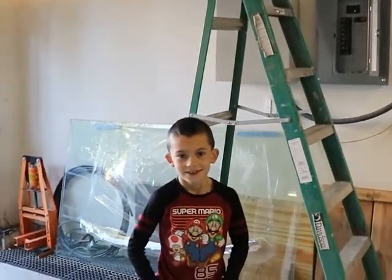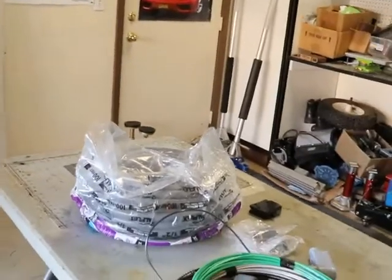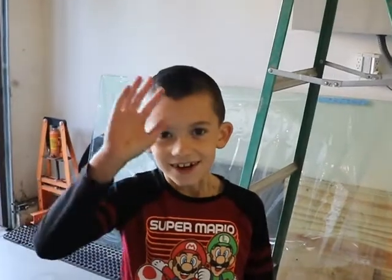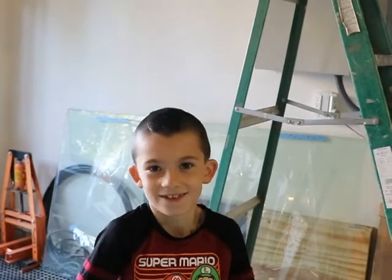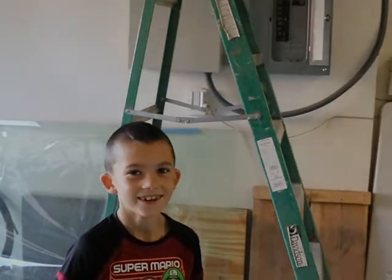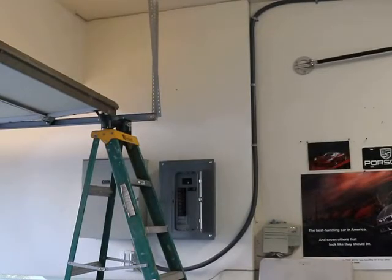Today we have Mr. Enzo here with us — he is my neighbor. I'm trying to run this conduit and he wants to be in the video. He's going to help me out, handing me screwdrivers and stuff. I'm going to run the conduit without the wiring at first to get the exact length I want. Then I'll take it back down, cut it to length, put the end connectors on, pull the wire, and put it back up. Measure twice, cut once.